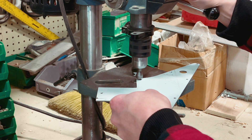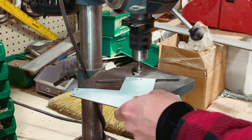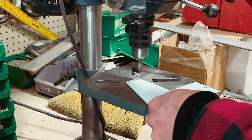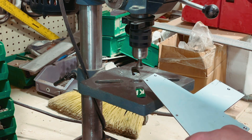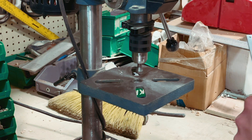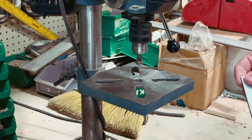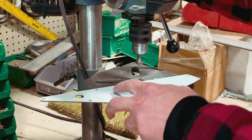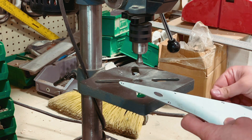What we're doing here is countersinking and beveling. I'm starting with the countersinking. For stainless steel you pretty much need a drill press, and you need a specific type of countersinking bit — one that has a couple of holes in it that basically slices off the metal. We're using a really high quality countersinking bit. You can set a depth for consistency, but it's actually quite easy on harder metals to feel it. We're getting all the screw holes countersunk — not the larger hole, which is for a kill switch.